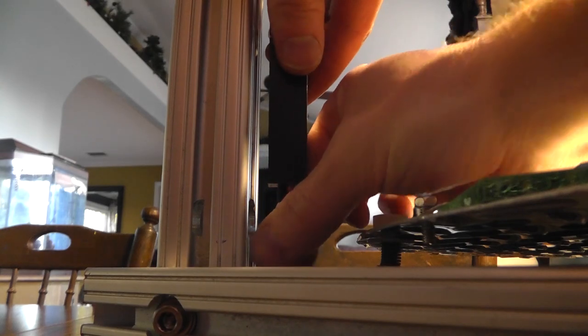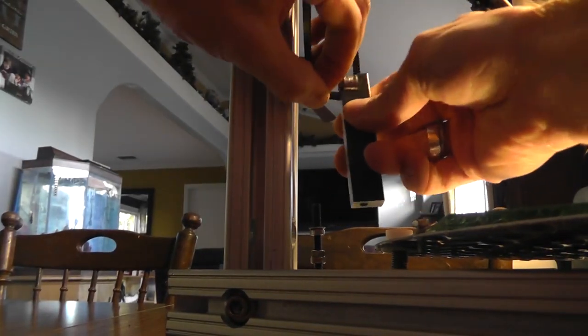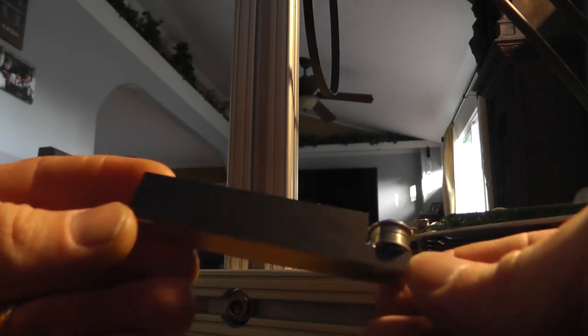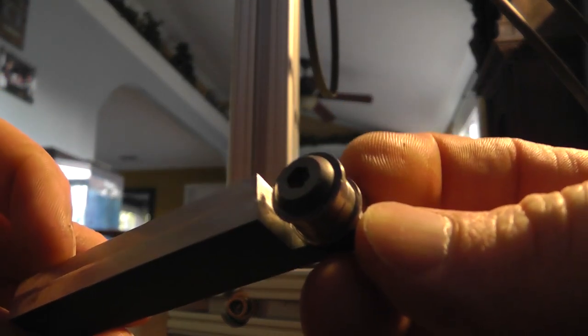All right, I decided I'm going to go ahead and show you how I take this apart. So, this is a bit hard to do because I got the bed in place, but basically, I don't have a wrench with me. So, this one is the tightener. And then I can pull down on the belt, turn this by hand. I don't even need this. Now, these are super silly extra long. Okay, there we go. And then the top, you can actually slip this belt out. There's just enough room between the bearing in the aluminum part.